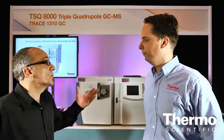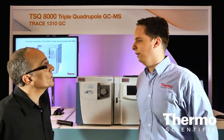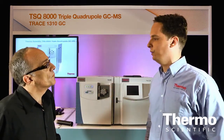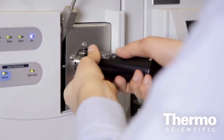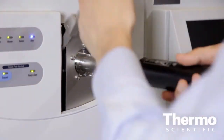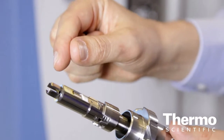Basically, we aimed to prolong the time between instrument cleanings. And when you do have to clean or change the source, that's another area where the TSQ-8000 shines. We have the ability to remove the entire source without venting the system, so any part in the source that requires infrequent maintenance can be pulled out of the source block without venting.